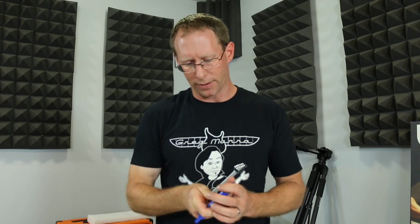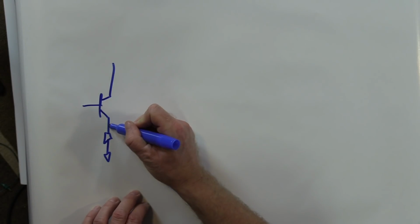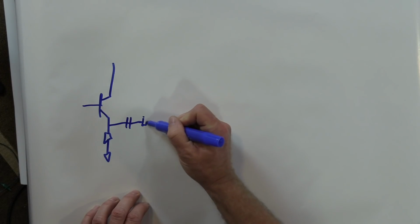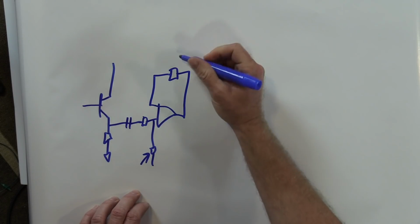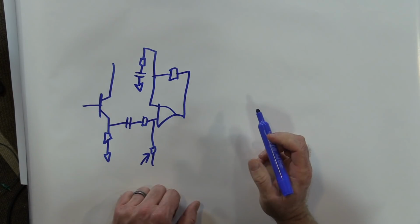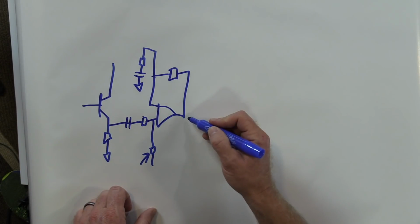All right, I'm gonna use the same pieces, okay? So I'm gonna go through a buffer, because we gotta be buff. Then I'm going to, let's see here. Okay, resistance and capacitance and all that stuff, right? Ignore this, that's just to make the op amp work. All right, so we're gonna keep some gain here, because this is set up as a non-inverting op amp, the way this is routed. You can also set it up to be an inverting op amp. But that's one op amp, okay? This same piece is what I'm saying.